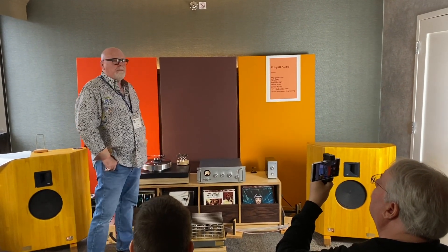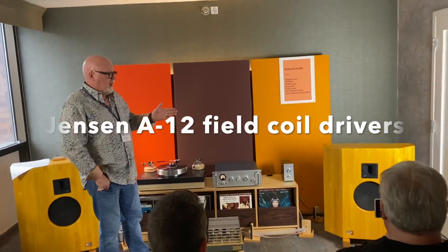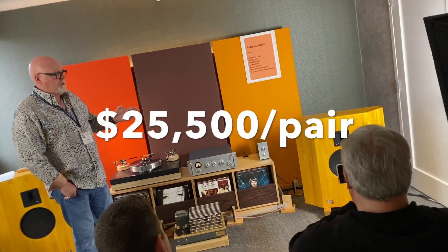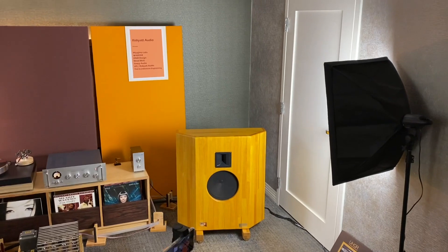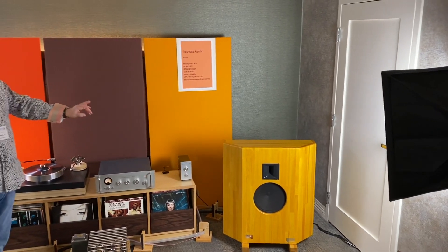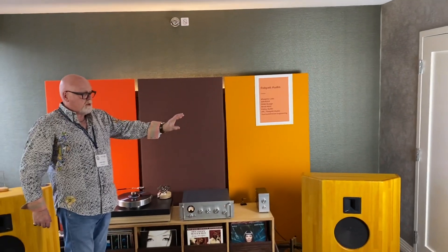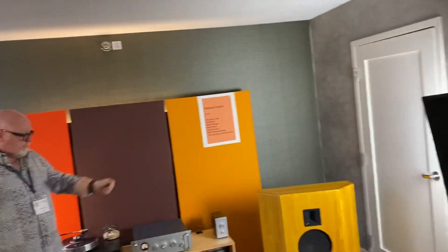This is primarily a Miyajima system. These are the first time Miyajima's prominent loudspeakers have been seen outside of Japan. They use antique Jensen A12 field coil mid-range drivers, or full range woofers, that have been refurbished. They use antique Electro-Voice compression driver tweeters — and that's not a plastic horn, that is a resin Electro-Voice horn. In the back of this open baffle red Japanese red pine wood cabinet, on the floor at the back, is a tube power supply designed by Miyajima to energize the field coil driver. There's also on the side in the back a paper and oil traditional crossover for the tweeter. Those are $25,500.